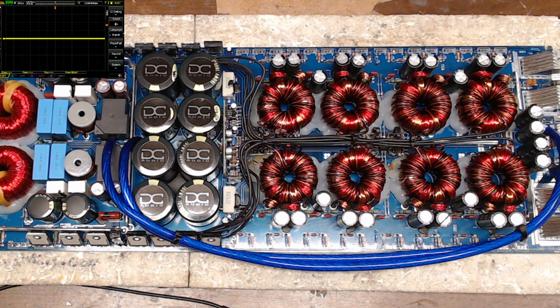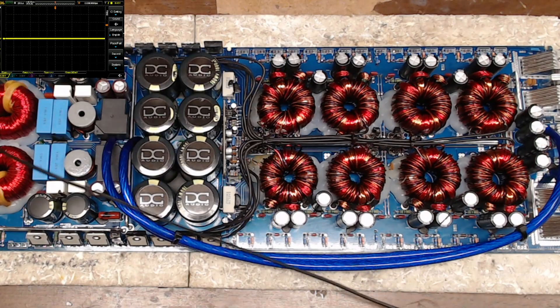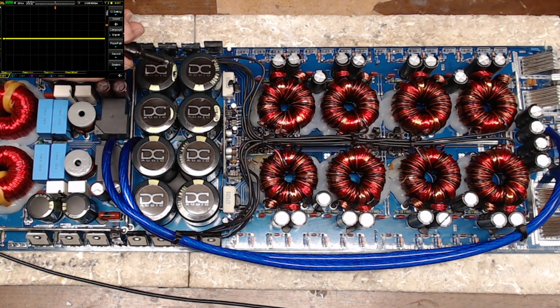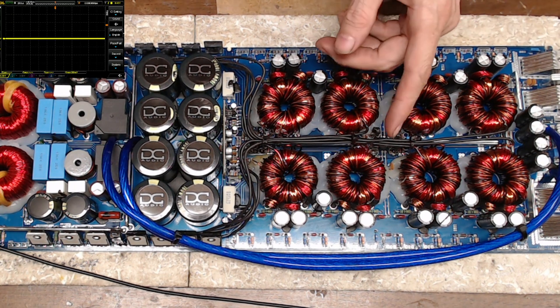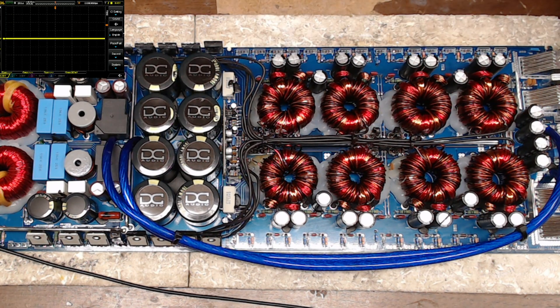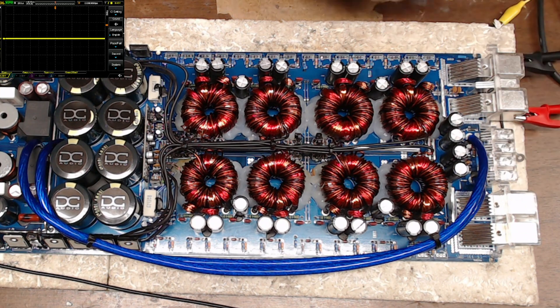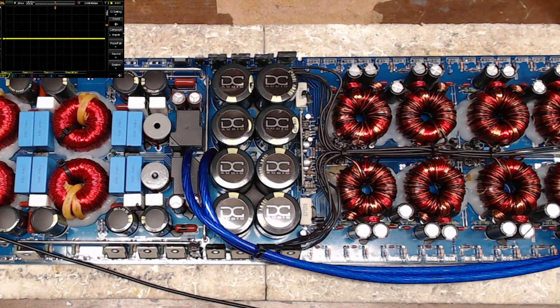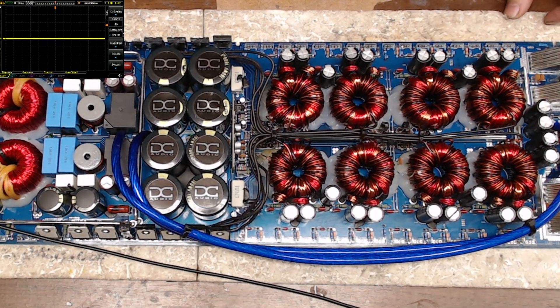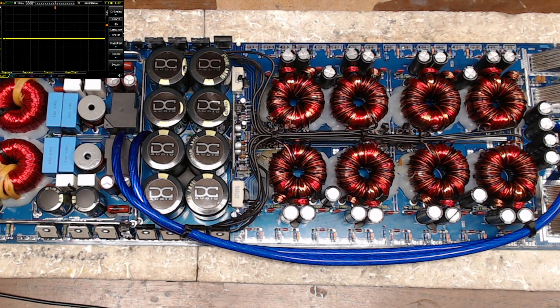We're back. I got all new gate resistors installed in the power supply. We're going to fire it up and double-check that every gate pad has a gate signal. I also got a comment on the previous video about the chassis grounds — it's hard to see but you can see the chassis ground leads sticking outside the board. As long as they're sticking out each side of the board, we're good to go. Let's fire this up and hopefully there are no solder bridges.